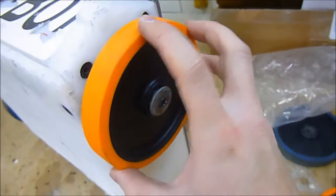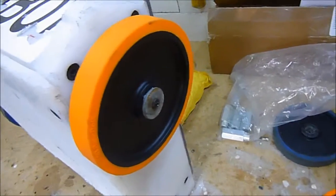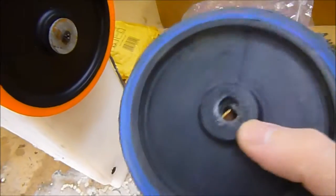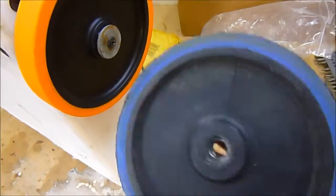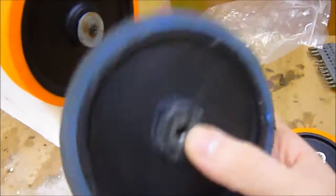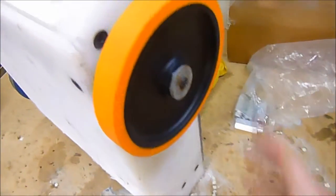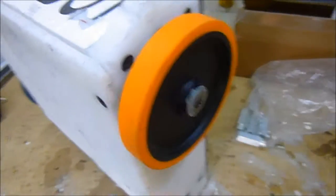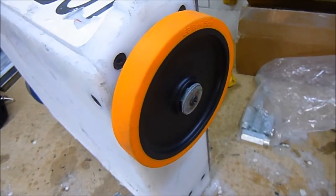And obviously because of the hex, the wheel is locked, so whenever the drill motor rotates, the wheel's going to rotate. The downside with using the nut insert method is that sometimes the melted plastic can wear away with the force, the nut can start spinning inside the wheel, and you lose your bond between the nut and the wheel. It can also make it a bit of a pain to get off as well. So using this means every time the motor turns, the wheel's going to turn — just the same as using the Banebots adapter hubs for the P60 gearboxes and so on.